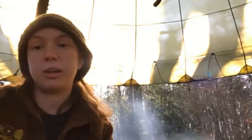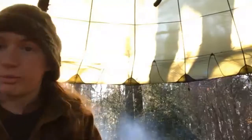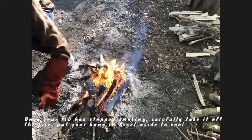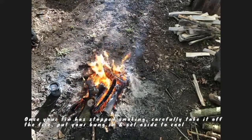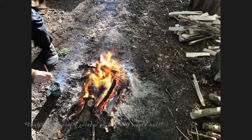There will be lots of smoke, and if you take a flaming twig to that smoke, you'll have a flamethrower. As I said, that's all your volatiles coming off. Mine is just about ready. So using the welding gloves, I'm going to take this out of the fire — and actually, the bottom of the tin is glowing red hot. So I'm going to pop that down and we talked about putting that bung in; I'm going to pop that bung in now.